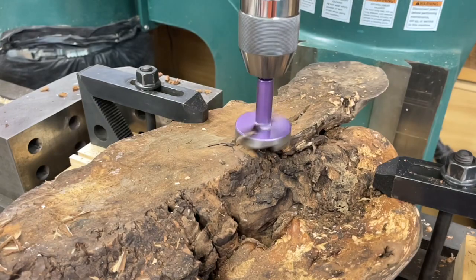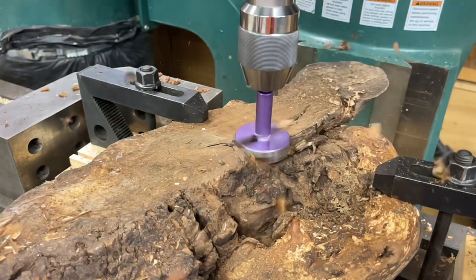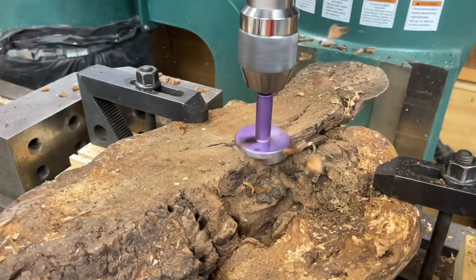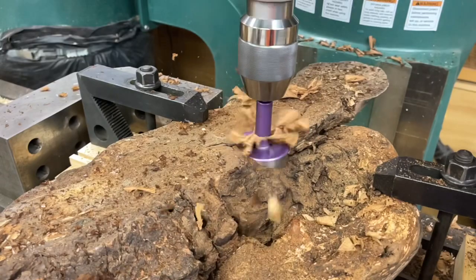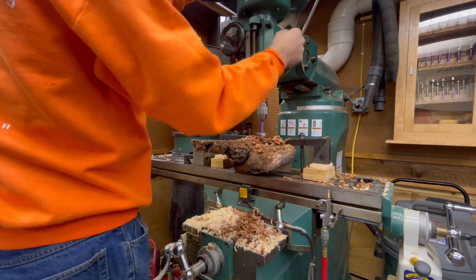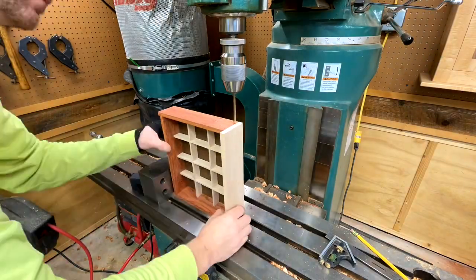I have found that the rigidity and the mass means you're always favoring going to this machine for as simple as drilling holes — like drilling a hole with a Forstner bit into a burl with a very uneven surface, where the Forstner bit needs contact before the cutter actually reaches the surface of the wood. If you try to do this with a regular drill press it just ends up walking all over the place. The milling machine just laughs at it. As simple as drilling holes, like I was doing in my last jewelry box video, it makes everything a joy.